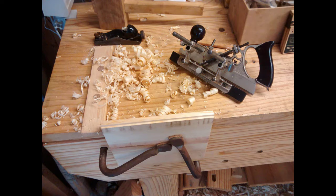This is a test joint that I made — the tongue part of the tongue and groove. The tongue and groove joint is mainly used when you're trying to make a wider board, joining two boards together on their long edge. That's exactly what we want for the back of the tool chest. We're going to assemble three different boards using tongue and groove joints to create one big board.